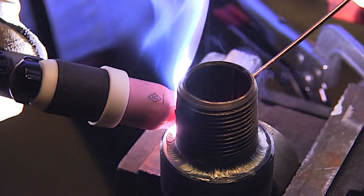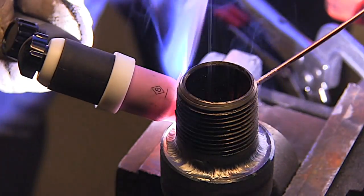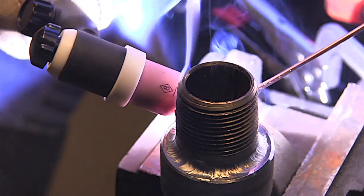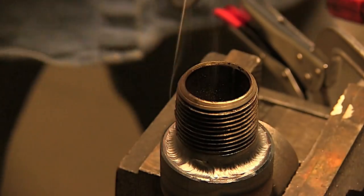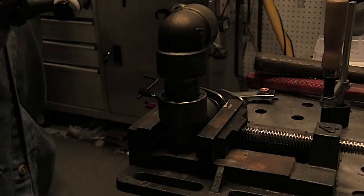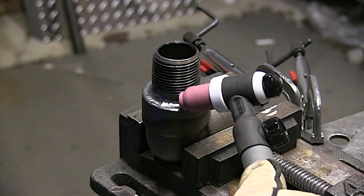I'm actually moving the vise around here — I didn't tighten it down enough. When you're walking the cup you put a little pressure on the piece to keep the cup from slipping, so it's a good idea to have your piece locked down. Typically this would be done in a tripod vise like a rigid tripod vise where you could walk all the way around the part. When you hit a tack, you can pull your filler wire out for just a minute so you don't deposit a really heavy section of metal, or you could just go right over the tack — it really wouldn't matter a whole lot.